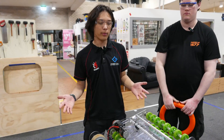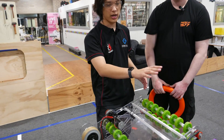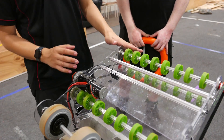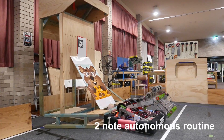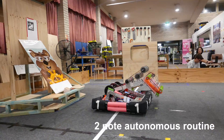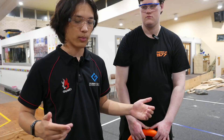The design of this robot has made it really simple for the control systems and autonomous. Because we have the intake on the front side and it shoots out the back side, in our autonomous routine we can just drive back and forth between the speaker and the discs and we don't have to turn around. That also helps because we don't need to add extra sensors — we can just do it by time.